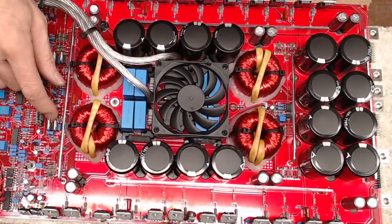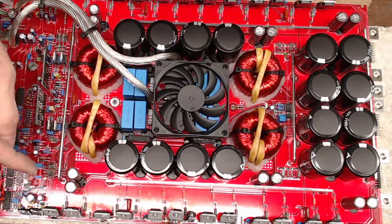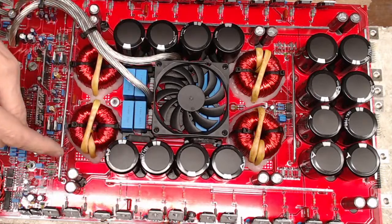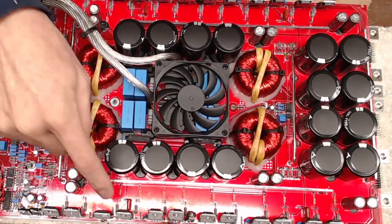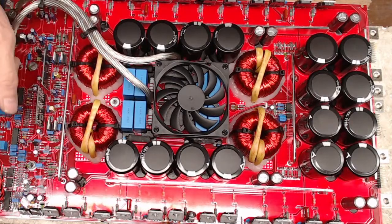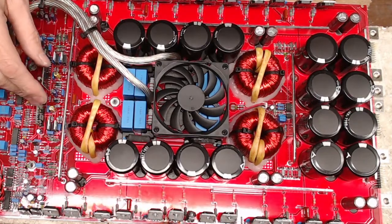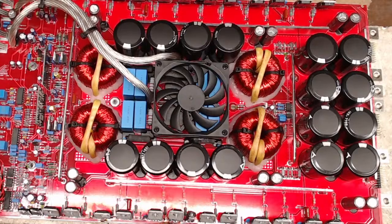And that's when I go back through and change the buffers that are in between the drive IC and the output transistors. If you look at it this way, that short's got a long way to go. You'll short the transistor, it'll make it through the gate resistor. If the gate resistor doesn't open, it'll make its way to the buffer, the IC that's in between the drive IC and the transistor. And if it makes it through that, then it makes it up to the card. So it's got many steps to go before it makes it all the way to the drive card. More often than not, it doesn't make it all the way back. I have yet to replace the 2184, which I do have on hand, on one of these cards, because it usually stops right here at the buffer transistors.